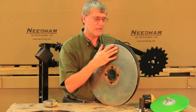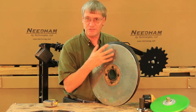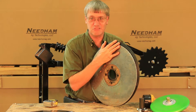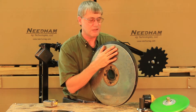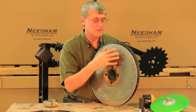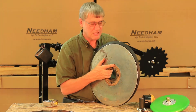Growers often ask how long do a set of seed boots last? My common response is: how religiously do you replace your disc blades? If you let your disc blades get less than 17 inches, the seed boots are going to wear significantly faster compared to someone who maintains their disc blades and replaces them when they get down to about 17 inches in diameter.